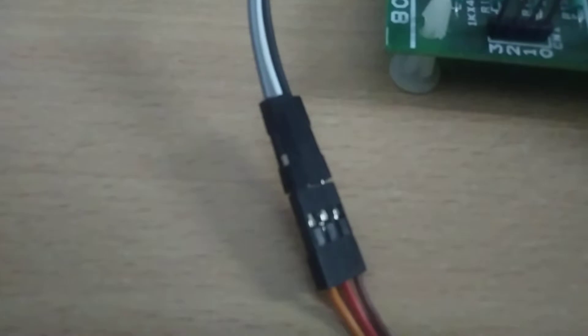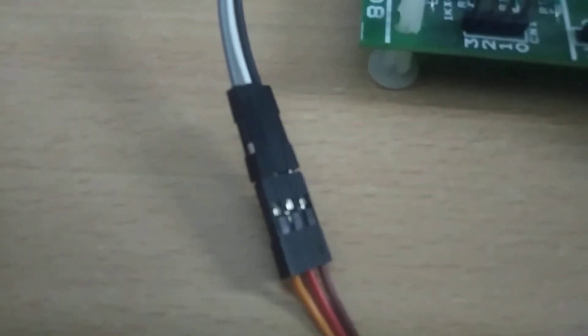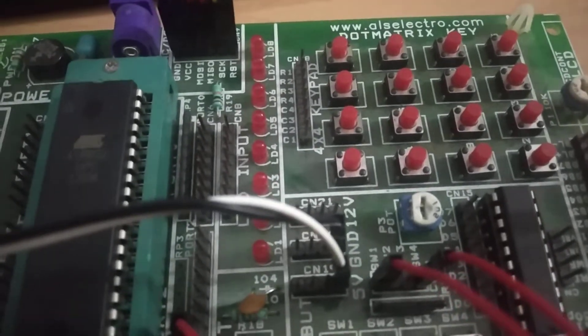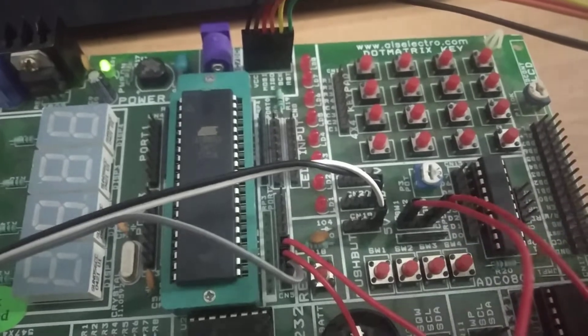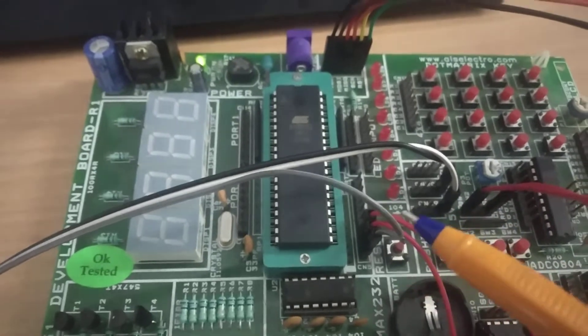The red, brown, and orange wires are connected to another connector where red wire becomes white wire and brown wire becomes black wire. White is power supply plus, black is ground, and orange is connected to the gray wire which is connected to the PWM pin. The white is connected to 5 volts power supply, black is connected to ground, and the gray color pin is connected to P2.1 where we are generating the pulse width modulation. Gray color is the orange color wire with respect to the specifications.